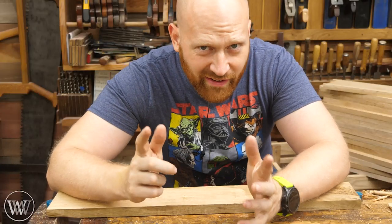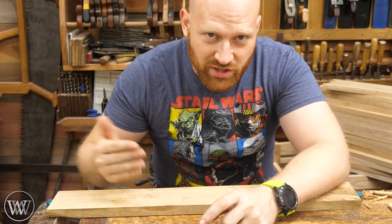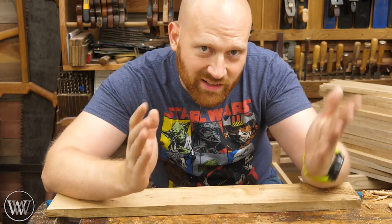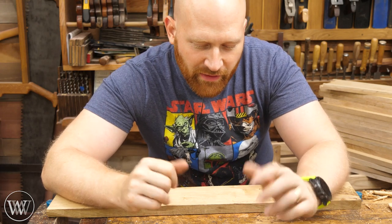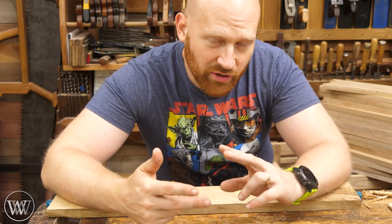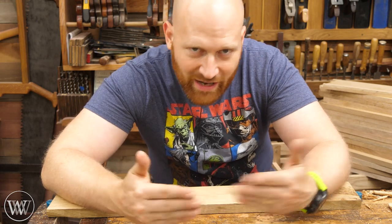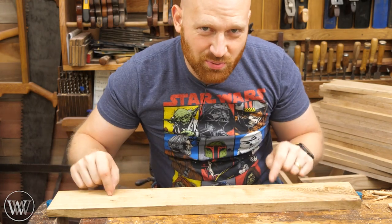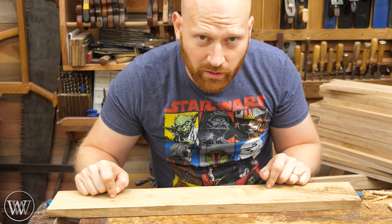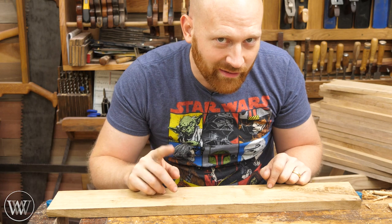The reason white oak is so difficult: number one, it's very dense. Number two, it has a lot of silica in it, which dulls blades rather quickly. Number three, it is a ring-porous wood, so it is very fractious — when the blade goes over it, the rings want to separate, split out, and give you tear out. With curly maple, for example, it's much more homogeneous because it's diffuse porous — the rings don't naturally want to split out as much as on oak. In my book, figured white oak is pretty much the most difficult wood to work. But if you plane it well, it's gorgeous.